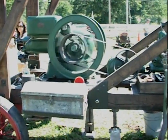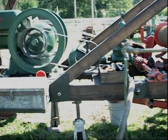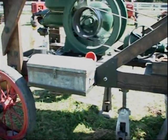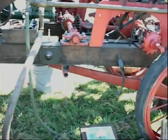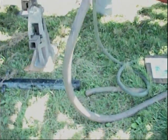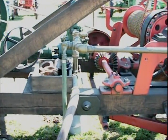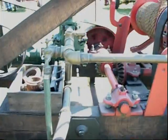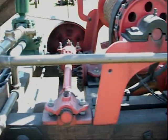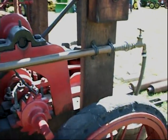This red line is your suction line, and then you've got your other one that goes up to the top of the water swivel — see the hose going up. The suction line is right here for the water pump. And then the copper pipe running along the side there is the one that goes up to the water swivel, which pumps the water down the hole while you're drilling.